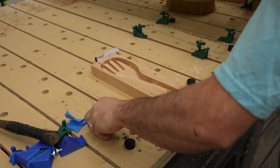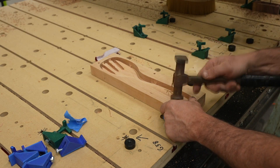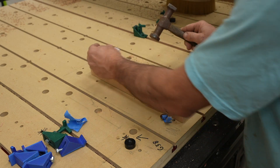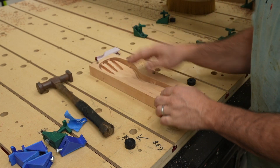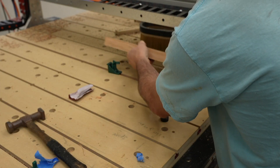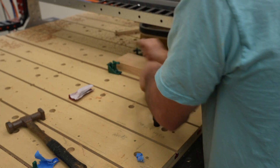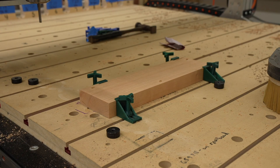After I carve the inlay I remove the work piece from my CNC table and clean it up a little bit with just a bit of sandpaper, because I don't want any fuzzies to raise it up and cause issues when machining the back side. Whenever you do two-sided machining you have to have a way of aligning the work piece. I do this by first drilling holes in my spoil board — which I did off camera because I've made this project a lot — and the matching holes are on the top of my work piece. I go ahead and put some dowels into those holes. If you're doing this for the first time you probably want to use quarter inch wood dowels, but I've done it a lot so I use quarter inch metal dowels because I can use them again and again without them getting destroyed.